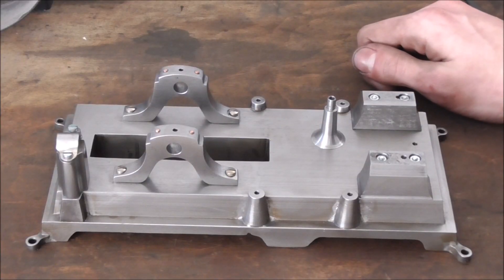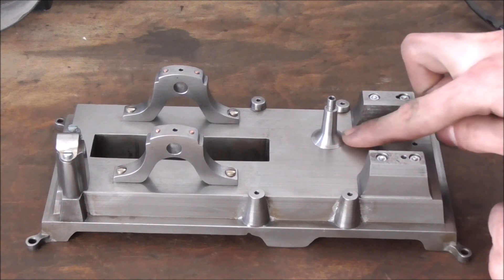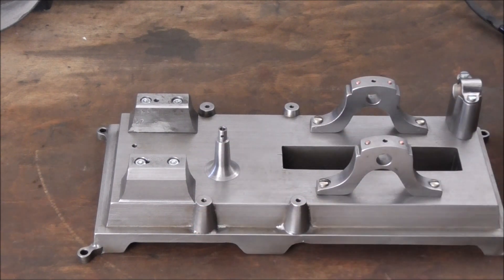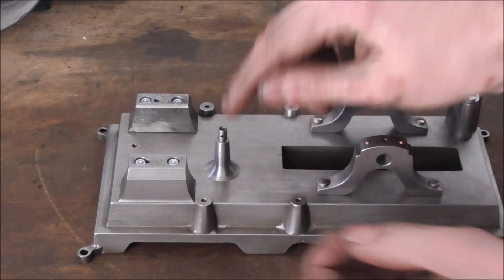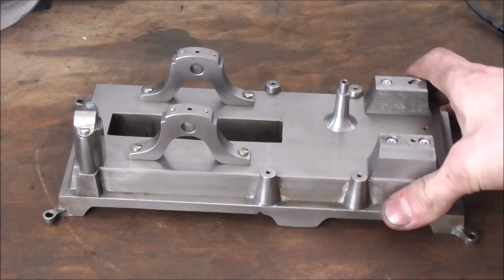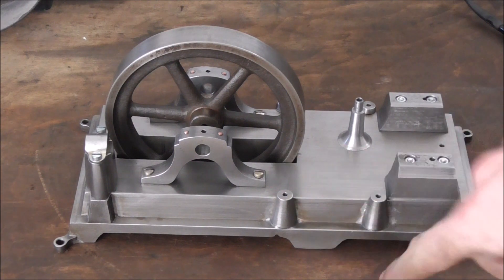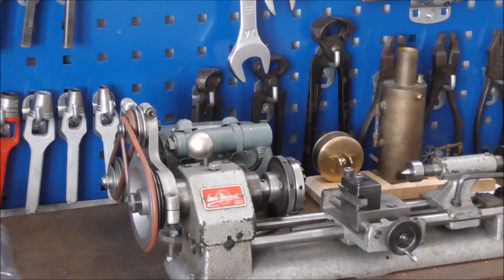With the memory card nearly full, here is the final column already mounted on the base. I left the sharp corner at the bottom so the transition is as seamless as possible. Off camera I drilled a 1.6 millimeter hole right in here — later a screw will go through with a 1.5 millimeter pin on the end, sticking into the bore to keep the governor shaft from falling out. This is really starting to look like a steam engine, and I'm very happy with the results. In the next episode we'll tackle the tiny screw-on parts, mostly made on the little Emco watchmaker's lathe. Alright, see you later, bye.